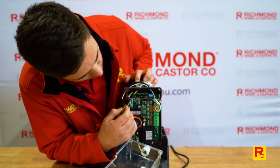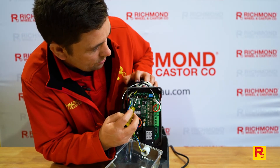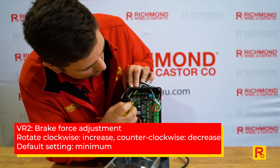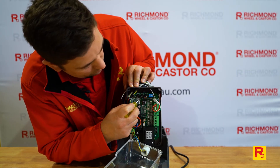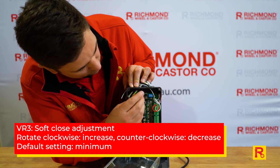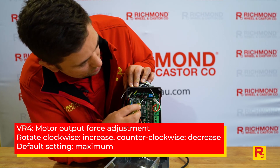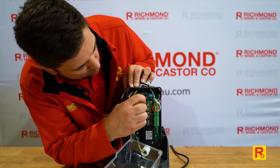You've also got four VR dials and they'll perform separate functions. VR one is the stall force mode. VR two is your brake force adjustment. VR three adjusts your soft close — this can be adjusted for a longer or shorter soft close period. And VR four adjusts the motor output force. You can turn this down, but it will be set to a maximum.